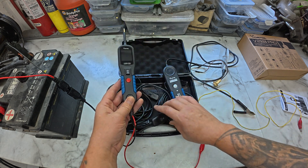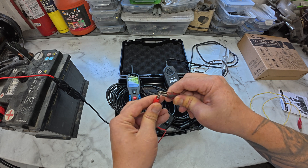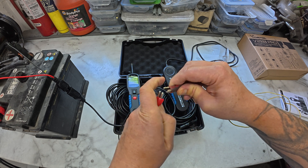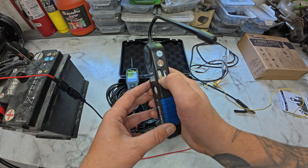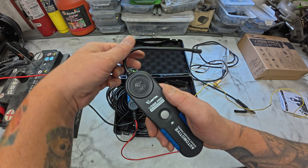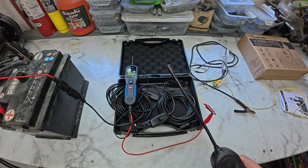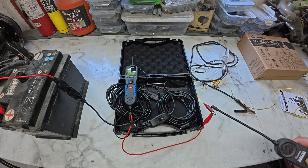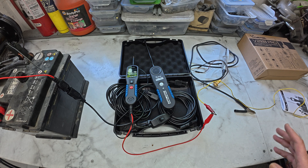This will not turn the tool on visibly, but the tool starts to send a radio frequency down the red lead. If we hook it up to this other wire, we should be able to extend that signal down this yellow wire. We turn on the breaker finder tool by hitting the wheel about halfway down and pushing the test button — we can actually hear some radio frequency coming through. I'll extend out the antenna a little bit and pass it along the wire. I got a good signal all the way to the end of the yellow wire, and as I passed away from it, it started to fade.